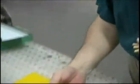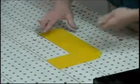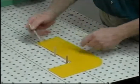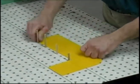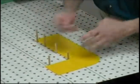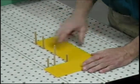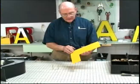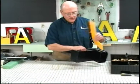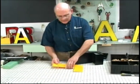To jig the letter, we'll try to use as many of the straight sides as possible to our advantage. And so we're going to put a row of pegs on this stroke and on this stroke. And we measured the letter face up, but when we're actually going to glue the letter, we're going to put the letter face down.